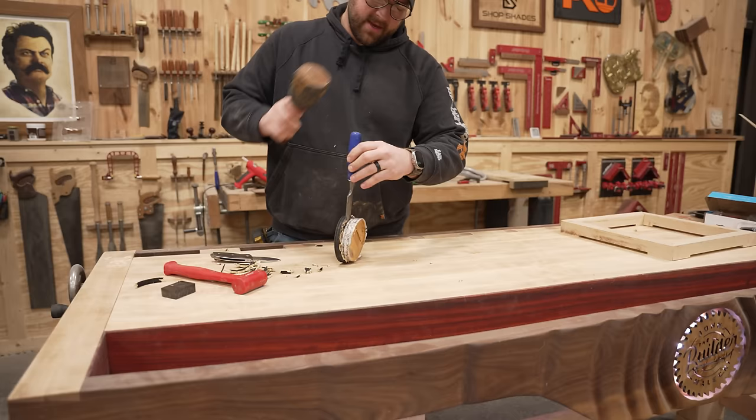I don't know. Chris is gonna cut a perfect 1-inch circle that matches the grain right here. Before I cut any holes, the thought is I'll do a recess of 1 inch so that that button fits, and then I can come the whole way through with this auger bit here from Wood Owl. Then this piece will drop in. After that, we should have enough room for it to go through. It's getting me pucker now the more I talk about it, but I think it would be pretty cool. If not, I can just put the button on the back here by cutting the hole right here. That will almost blend perfectly with it. It'll be a slight reveal, but it'll be super, super hidden.